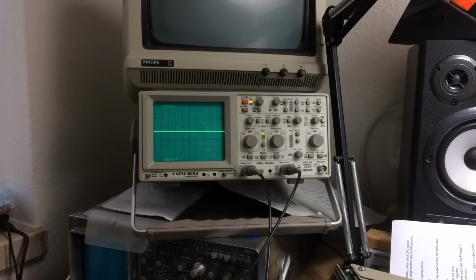So of course I should turn this on. So now it's on. And there's a little chip select. Reset. Yeah, there's our chip select pulse. So most likely the 8502 is working. Okay, reset, chip select.